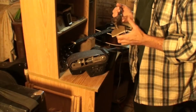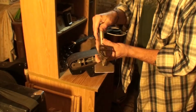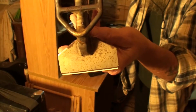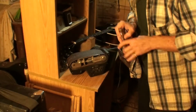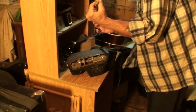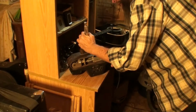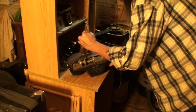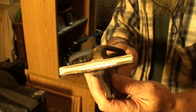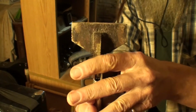I've showed this enough times before too, but I'll go ahead and show you again. The new subscribers maybe didn't see it. This is just a pair of vice grips I made, welded plates on here. I've got the saddle in there with 40 thousandths exposed. And this belt sander will do a very, very quick job. I'll just hold it down and grind it on there until I start to hit the vise. And then I'll know I'm exactly where I want to be. So here we go. And there you can see where the sander hit the metal. And we are exactly down, taking 40 thousandths exactly away.